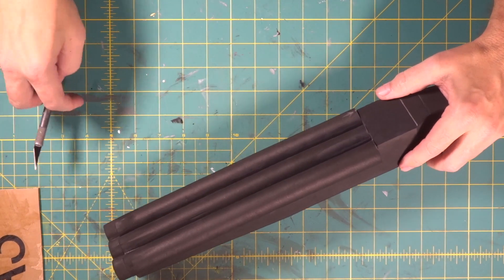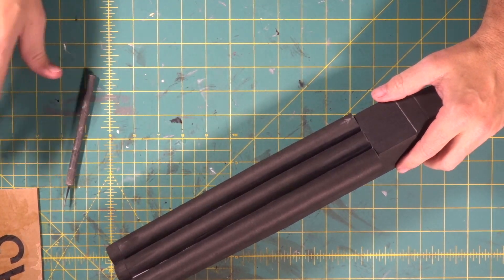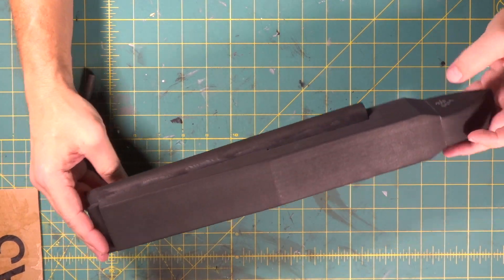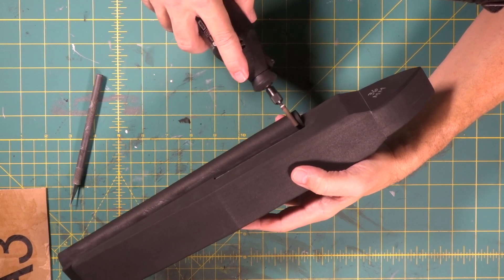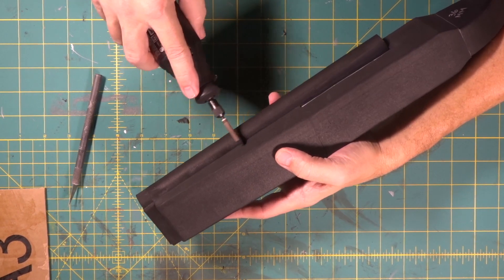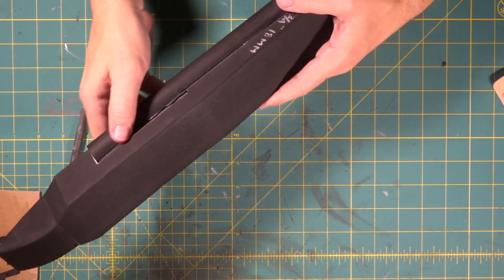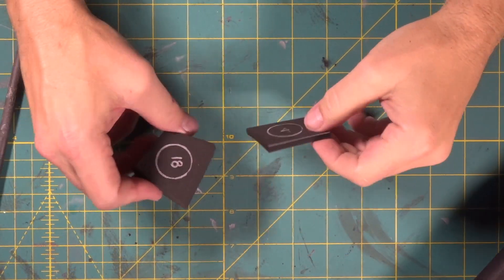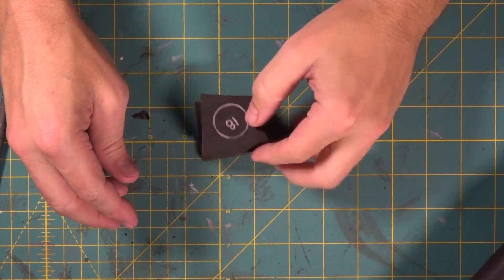You can see some of the dry contact cement, and the Dremel is awesome for taking that residue off so you can't even see it — we really cleaned up in here. There's some on the bottom too, let's take that off. We got all the residue off — beautiful, that's clean. Now we're going to come in with this four millimeter and this 18 millimeter — we're going to attach them because that's how thick we need this piece.